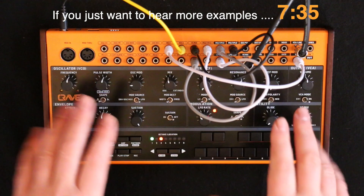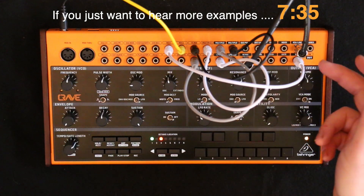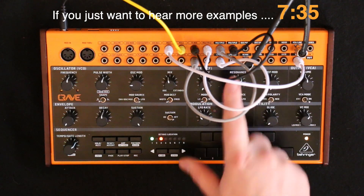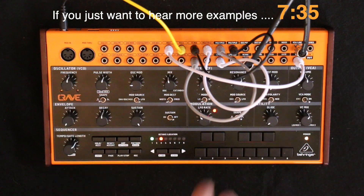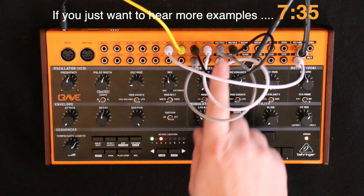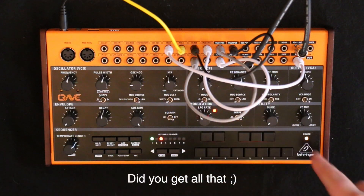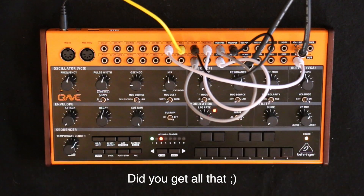So let's take a look at what I've done here. I'm using two outputs — the VCA and the VCF — and modulating between them using the LFO triangle output. Because that triangle output is going to two destinations, it goes into the mult, then the mult goes to the VCA level, and it also goes to mix in the VCF using the VC mixer. Simple. But let's go through it step by step.